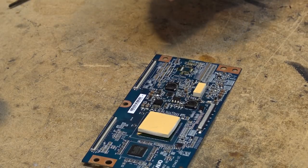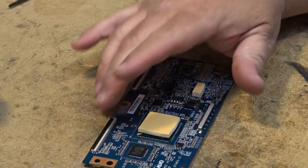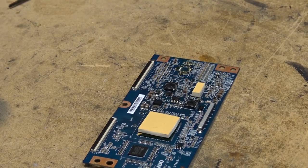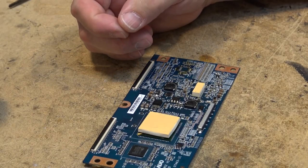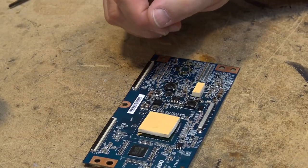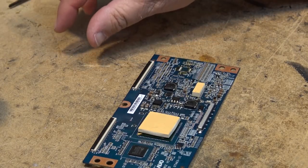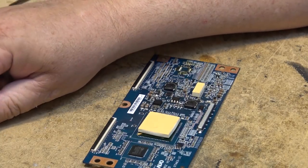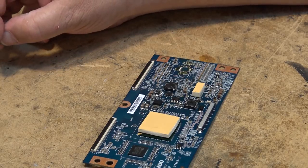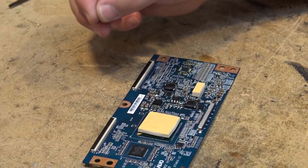And this is the way we learned in the field. This was actually a method that was taught by Sony, of all places. I got this experience using the razor blade. I actually use an X-Acto knife, but same thing, it's a razor blade. Cut and pick. This was how we did it in the service centers when we didn't have a hot air station, because at the time, this is going back into the early 80s, 84, 85, 86, when stuff that used these flat pack ICs was hitting the market.